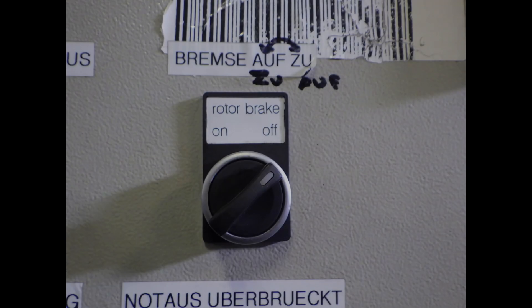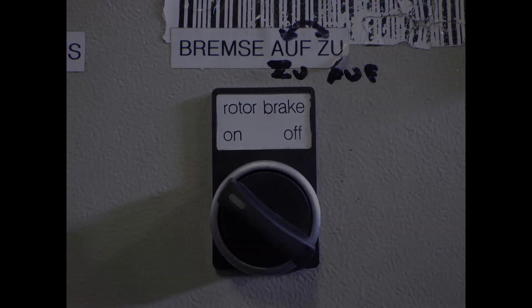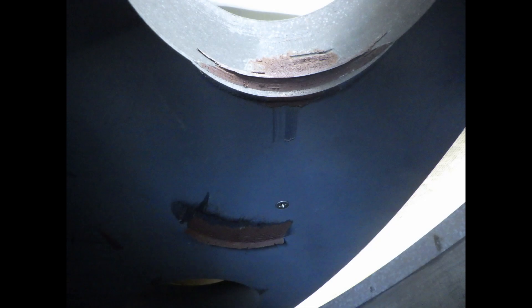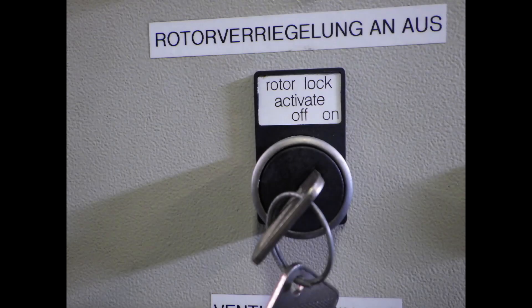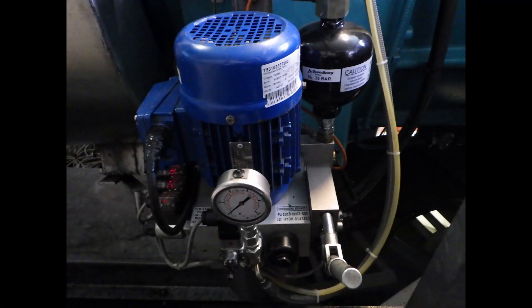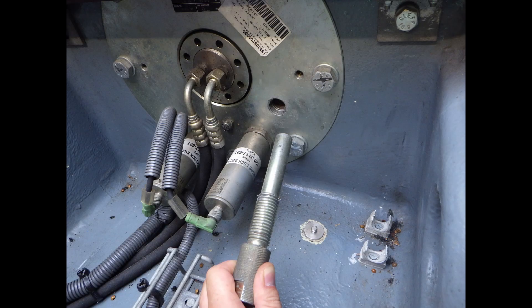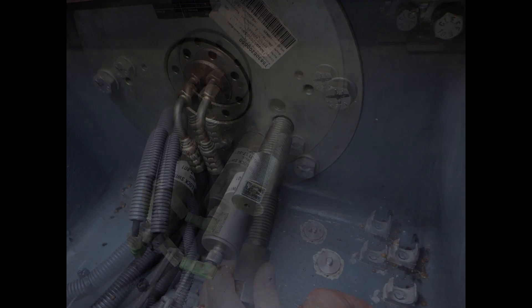You might find some draw marker lines to assist you, but keep in mind that once you reactivate the rotor lock brake system it could take up to five seconds until full brake force is applied. Please ensure you are in a good position before you engage the rotor lock pin to avoid any damage to the rotor lock disc or the pin itself. Activate the rotor lock by turning the key and keep the lock-on button pushed in until the pump ceases working. Confirm the pin is fully engaged by hand and secure it with the safety bolt for the unlikely event of a hydraulic pressure failure.